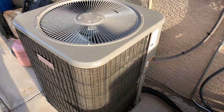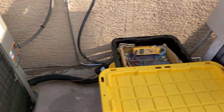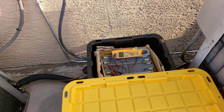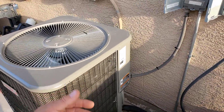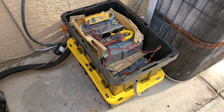The fan motor's getting a little noisy and it's actually causing vibrations, so it's already below the voltage that the utility power would kick in at. It's been an hour right now, so basically two tons of AC running approximately on 40 Hertz has run on these batteries in these two packs.